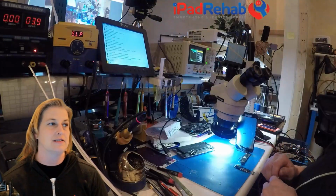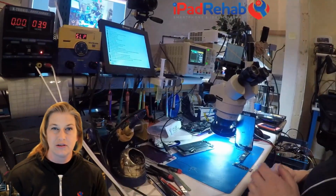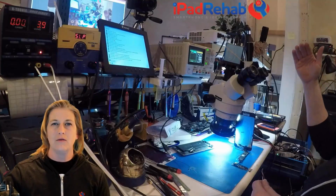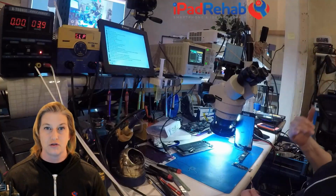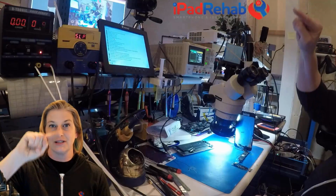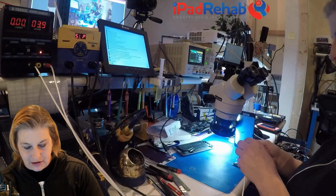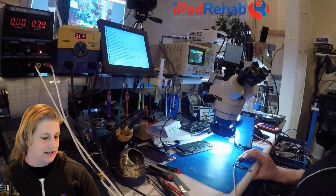Waking up because I want you guys to see DC power supply. So remember what it was doing before. If you just got here, this had a very unusual DC power supply signature where it started out normal, 0.2 amps, 0.3, 0.4, 0.5 amps, and then it would go as normal to 1, 1.1, and then it would drop back down to 0.3, and then it would go back to 0.1, drop to 0.3. We actually looked at it on the new graphing DC power supply, and we could see that it really made this heartbeat. 1 amp, 300 milliamps, 1 amp, 300 milliamps, and that was a really unusual sign, and it did not connect to iTunes. All right, so here we go now. Let's see if anything is the same or different.